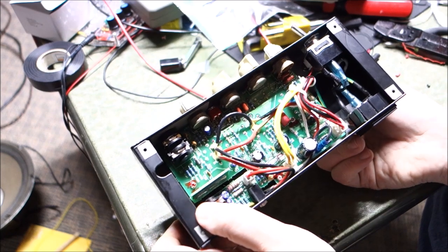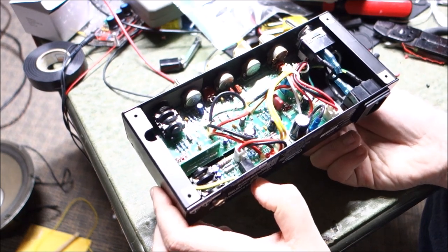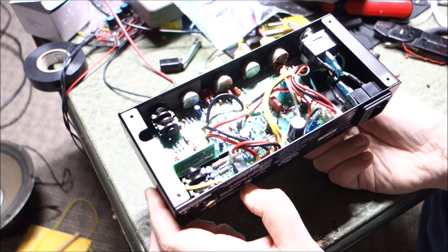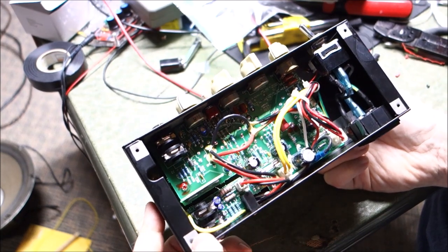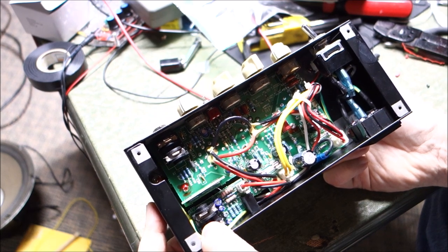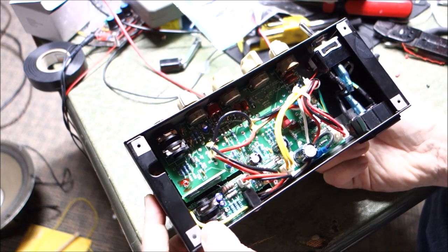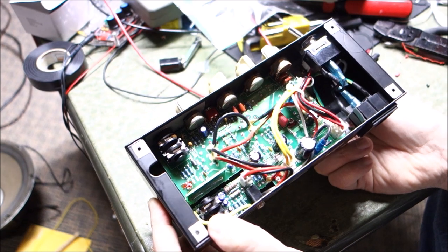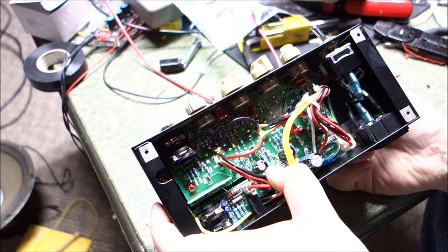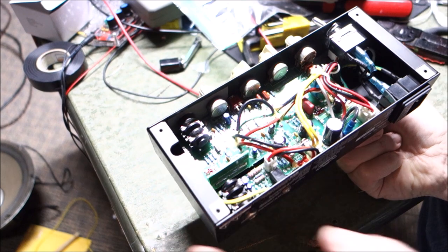It's very simple — done on two boards. There's a secondary output board for the headphone jack. When you're using the headphone jack and you remove the speaker, there's a set of power resistors here that act as a load. Being just a one-to-two watt amp, this 2-watt resistor is probably your load to handle the speaker not being plugged in, so it essentially makes its own dummy load — pretty cool. There are also two or three fuses: one for the heaters, one for the high voltage, and one for the mains power.